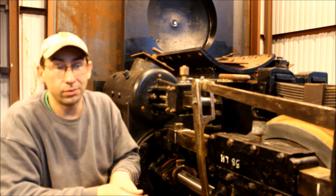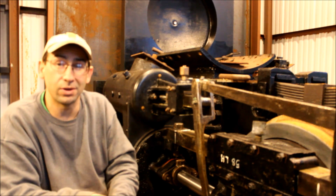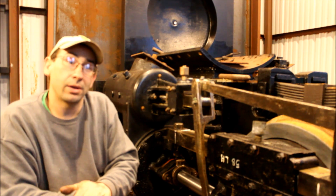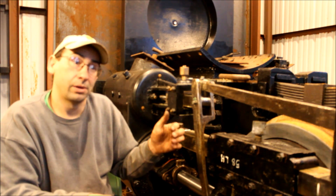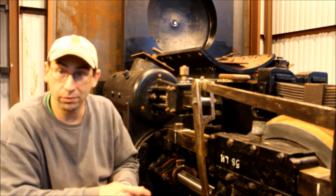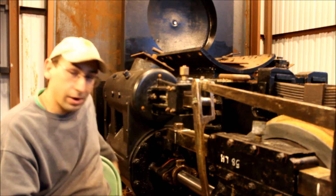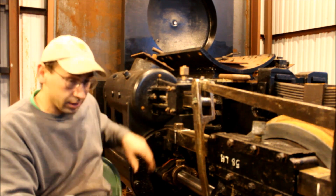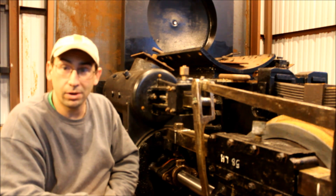I really like this design of locomotive. It's kind of growing on me, and I know it's an oddball, but it's kind of an interesting design how this was made. So when the boiler gets back in, we'll get to work getting it on there. We'll do another hydro test once we have it plumbed in, and then at some point after that's done, we will do our initial test firing of the locomotive and do a steam test - take the valves apart, take the cylinder heads off, blow steam through everything, make sure you don't have any bits and pieces stuck in there that's going to wreak havoc on things. Put all that back together and see if she can move again under her own power.